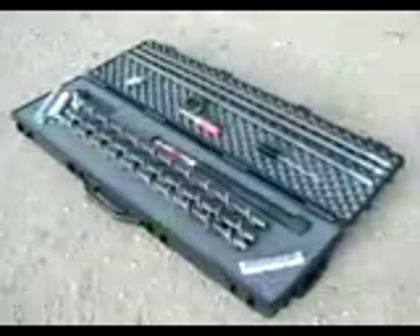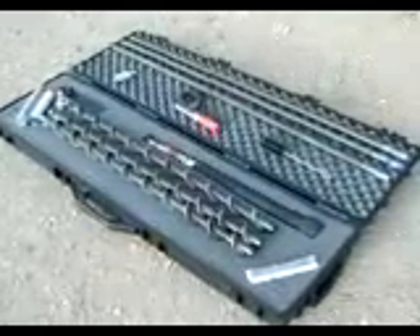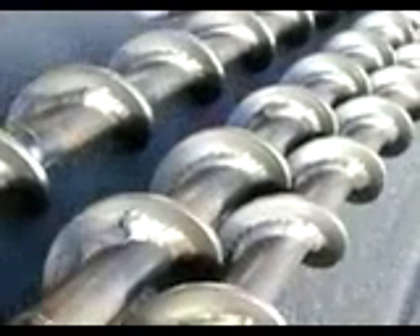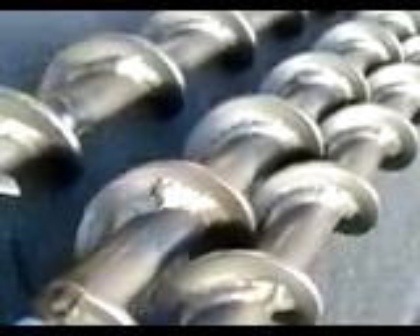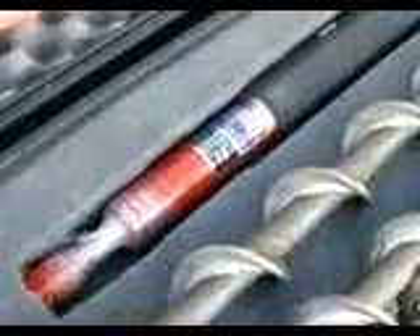The AMS flighted auger kit conveniently contains all of the items necessary for accessing a soil sampling point and then taking a sample. With the flighted auger kit you'll be able to access sample points at depths of up to nine feet. Using the supplied extensions and roto hammer drill, you can then collect an undisturbed soil sample using the AMS core sampler extensions and AMS slide hammer.